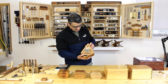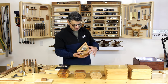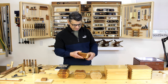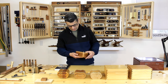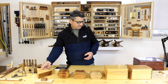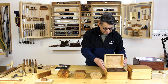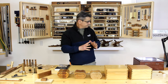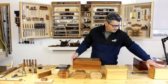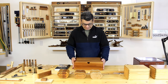Here's a more whimsical type of box - again a music box, but done with Spanish cedar. One of the features of Spanish cedar is a very nice aroma, though it does emit a sort of sap. It has a bird's eye maple top with Spanish cedar throughout - an interesting box with back-mounted hinges to make it simpler. The other boxes have fairly straightforward hinges - low cost hinges mortised in on the case side.